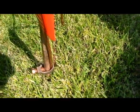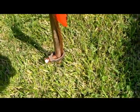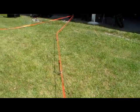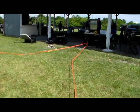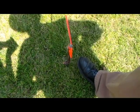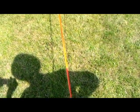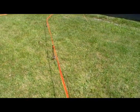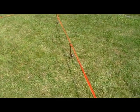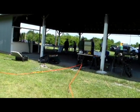One thing lightning will never do, no matter how much you want it to, is make a hard turn. So if you were to shape this wire along these rods with acorn clamps — up and down — in order to make the connection, lightning won't take that turn. It would side flash and go wherever else it could find a ground. You don't want that. So you use clamps that allow the wire to pass directly by the rod in a straight line, each rod draining off some of the charge until it's all dissipated.